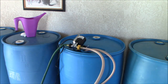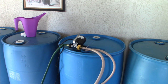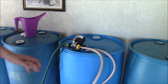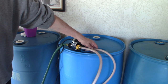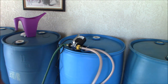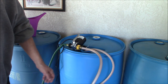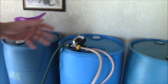I have about that much water left at the bottom — that's enough to move it. I want to keep that water in there to swish things around and dump out the sediment. It did really good. The pump is only slightly warm, caused no problems at all. I did have a little problem at the start, mainly because I dropped the required hose into the barrel. I also found that pushing the hose down and shoving the water through the tube got it started with no problem. I'm going to clean this up, then try that next barrel and time it.